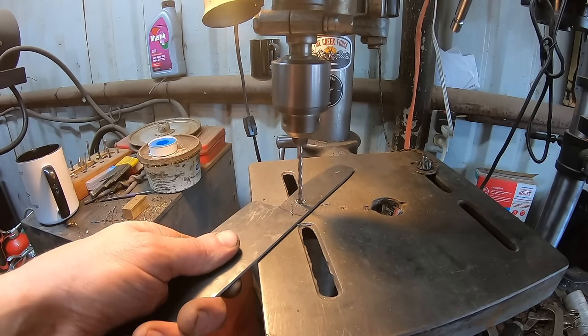All right guys, this is super exciting. This will be the first ever stainless steel sanmai blade to come out of my shop, ever. So I've got this finished ground, it's looking really good. And after the complete heat treating process, the 416 stainless here is softer, and you can feel that on the grinder, and also you can bend it a little bit as you would expect with a mild steel cladding or any other soft material. So that's all working fine. It just doesn't seem to work to process it quite the same way in the forging and then drilling and stuff. So that is something I'll have to look into a little bit more, but pretty happy with how it's turning out.